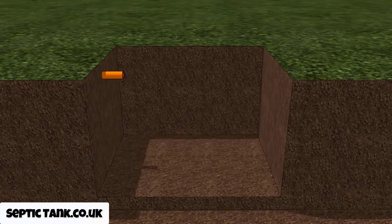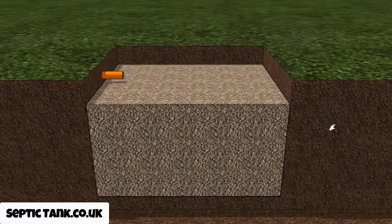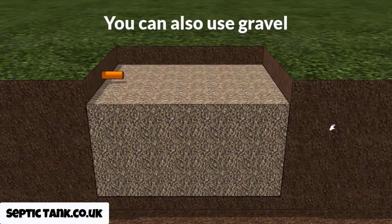Once you've done that, all you need to do is fill the soak away pit with gravel. Personally I like using 20 to 30 millimetre gravel — it's neat and easy to work with. But if you've got gravel of any size, like road aggregate, scalpings, or old rubble and bricks, in theory you can fill the hole with that. But if you want to keep everything clean, neat and tidy and adhere to building regs, you can't beat 20 to 30 millimetre shingle.